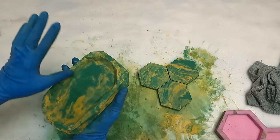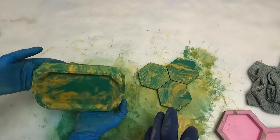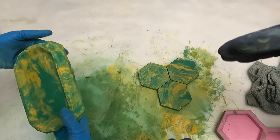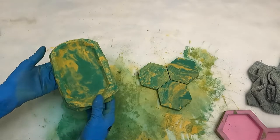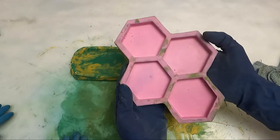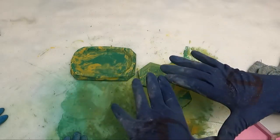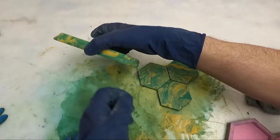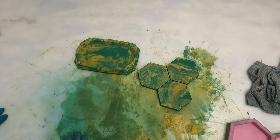We're not going to seal this one because it's too fresh out of the mold. Four hours is quick — if you demold something in four hours, don't try to do any work on it. Demold it, put it to the side, maybe cover it up again. We're just demolding at four hours to get our molds back so we can cast again, but let them sit for 24 hours before grinding or sanding edges — it's still pretty soft and hasn't hit maximum cure strength. The color might get a bit lighter too as it loses moisture.